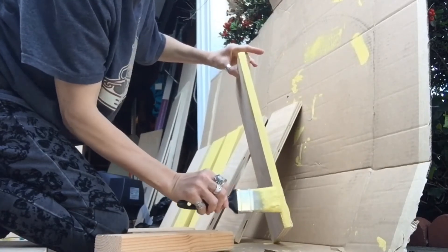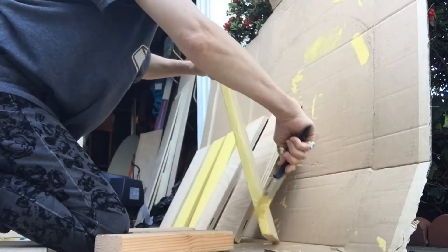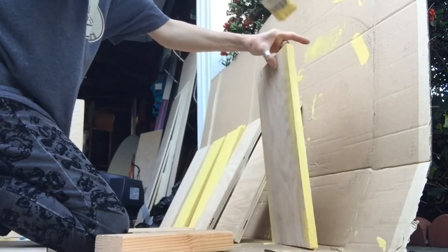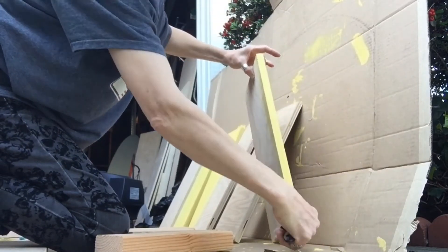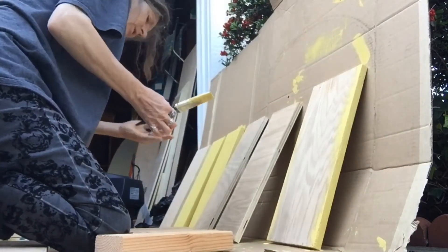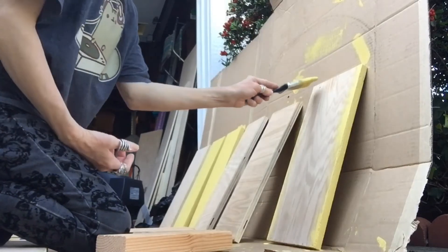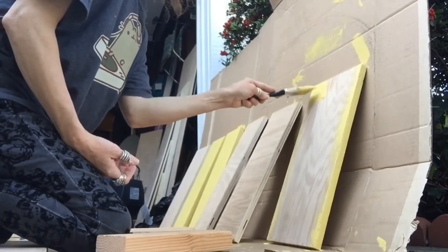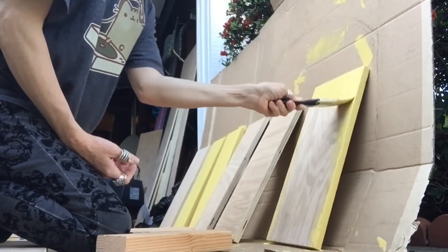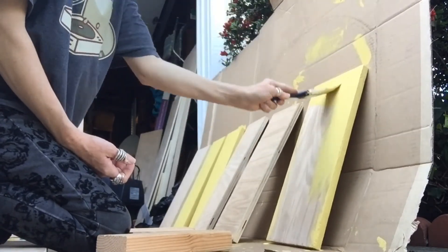Last time I didn't paint them — I just cut them and put them up, hammered them together. I don't think that's a good idea. They need to be painted to help keep the mold issue on your boards away.